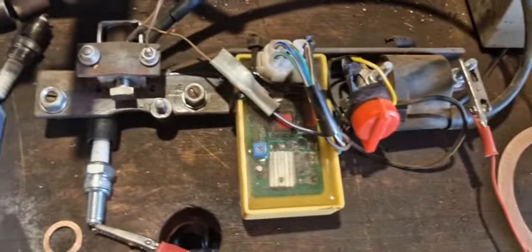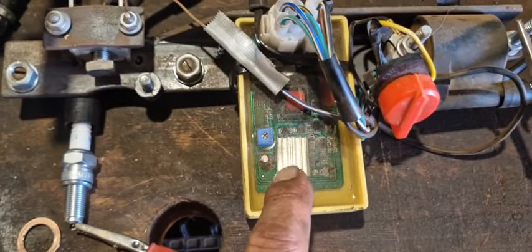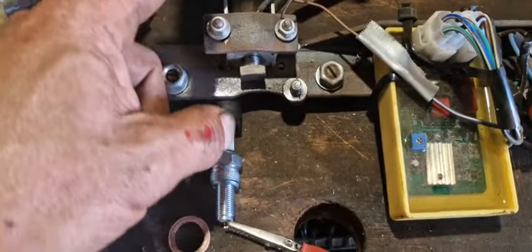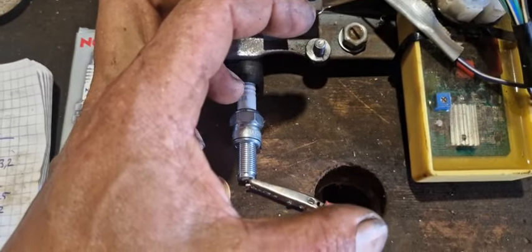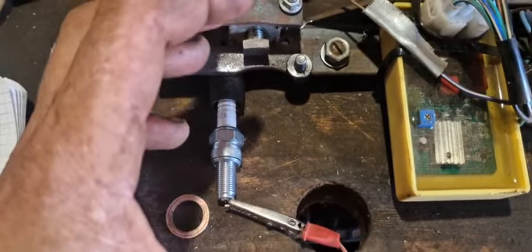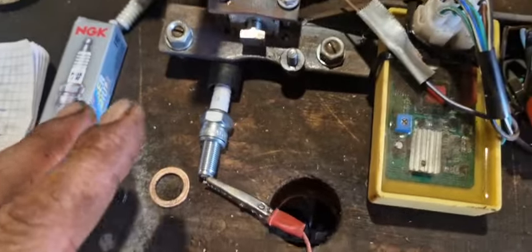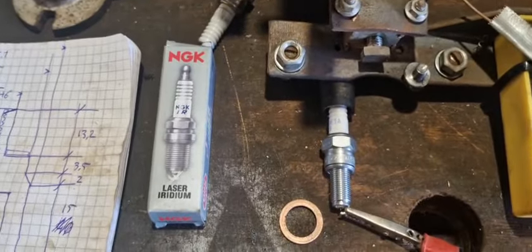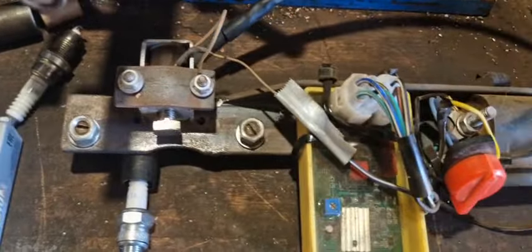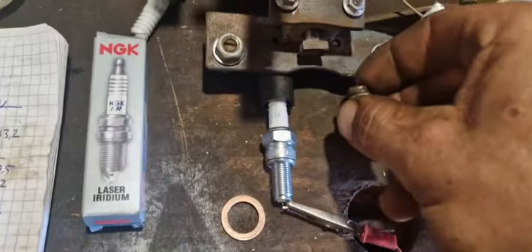Next thing is the ignition. I used an AliExpress DC CDI. I wired it up with the solenoid coil, because the small diameter speed reduced pulley to start the diesel engine is so small in diameter, and it's geared down 2. So it only rotates about 750 RPM at maximum speed. So the normal scooter type pickup coil, as it's called, didn't work so well. But now, I'll show it, hook it up to the thing, and if the magnet gets near.